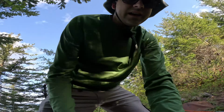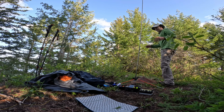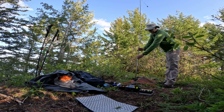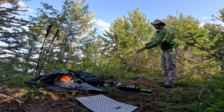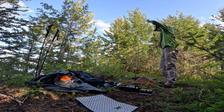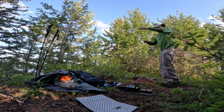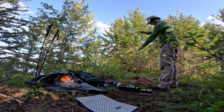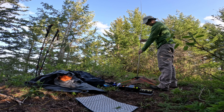This isn't working. And I suspect, I mean, it's terrible band conditions today. If you were hoping CW was just going to save you from bad band conditions, there you go. It can't work miracles. But what I am going to do is try this antenna on 15 meters first, because sometimes 15 meters survives solar storms better.